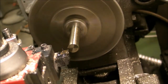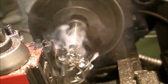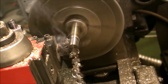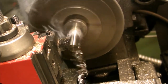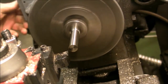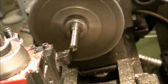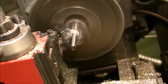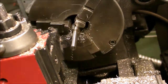I'll let you hear the first cut here. This first piece we're turning down is for the small end of the plunger. We'll turn it down to approximately a quarter inch and then stop once it has a good slip fit for the smaller hole that we created for the plunger in the first piece.